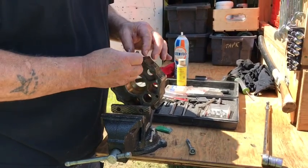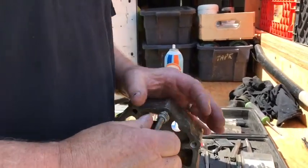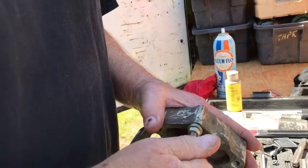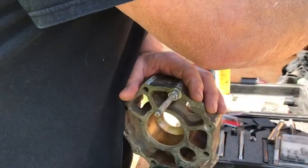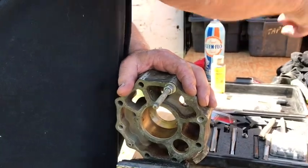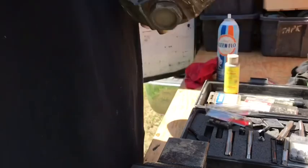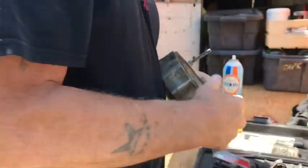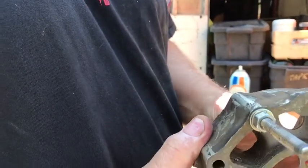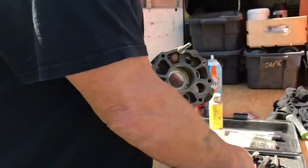I'm going to put this in there. Now, this here would only take like 20 or 30 pounds pressure, okay? And it'll probably go, right? It'll probably break off. Now, I'm going to put about 40 foot-pounds on there, and just look at that. That's as tight as I can go. That's probably 40, 45 pounds of pressure, and that never stripped out. That's how good heli coils are.